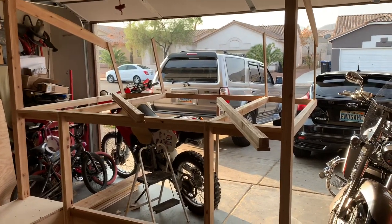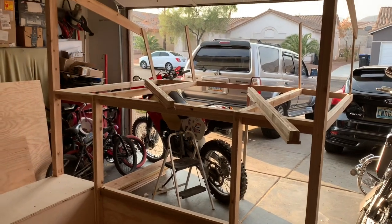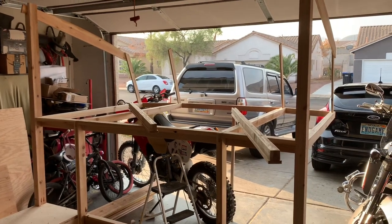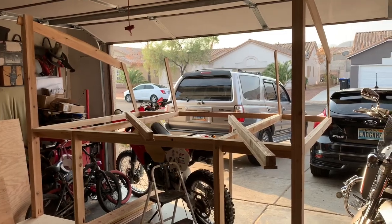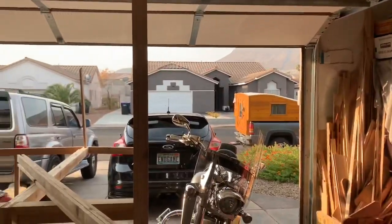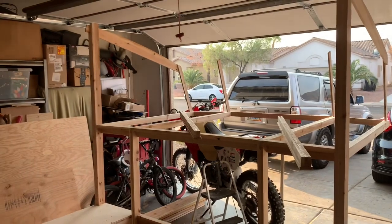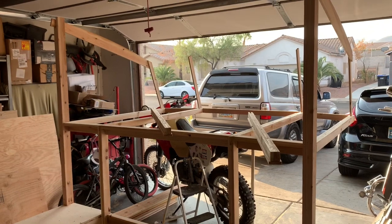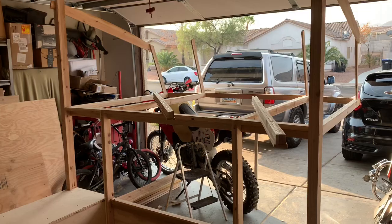But another component is the idea that one building step, in this case the skeleton, if you will, of the camper, is only one piece of its overall combined strength. The other combined strength comes from the incorporation of the other elements. As you can see on the camper out there, the camper is skinned, as I like to say, with the planked boards over the skeleton. When you incorporate those, though that forms an exterior surface, it also provides a very strong and rigid exterior structure to the camper. And that's another thing to consider.